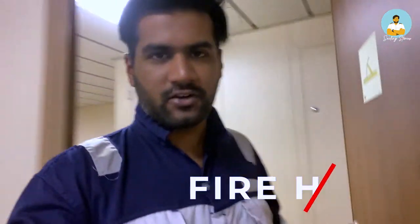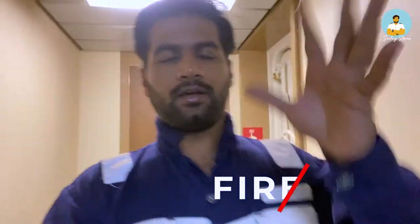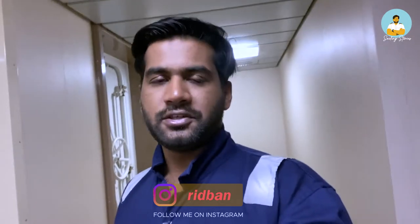Today I'll be going on deck and I will be greasing the fire hydrants. Fire hydrants are used for pumping water, the sea water basically, to fight the fire. So today I'll be freeing those hydrants and greasing them. This forms a regular maintenance on deck, one of the important jobs of the third officer. These fire hydrants need to be in a free condition and they need to be maintained and greased on a regular basis. So today I'll be doing that, so keep watching.